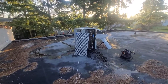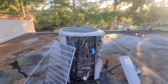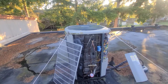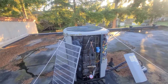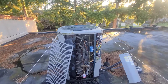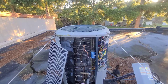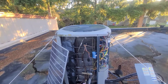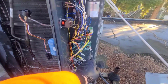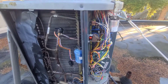I'm just getting out here on a service call on this American Standard heat pump. To give a little back history, our company did a repair a few weeks ago on this system — it was basically tripping out on high pressure, short cycling. We did a kit bundle on these units with electronic expansion valves: the valve body, the stepper motor, the EEV board, a couple of sensors, and a pressure transducer.